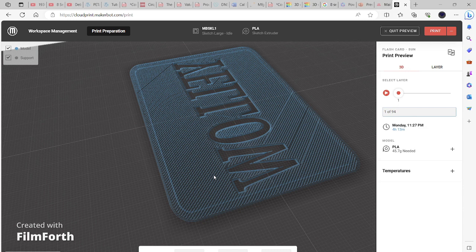And on the videos, I put the painter's tape and hot glue sticks, or Elmer's glue sticks, but it didn't do anything. I even changed the layer height and the bed height, same thing. It would never stick onto there. Like this one right here on the MakerBot itself, on the sketch.